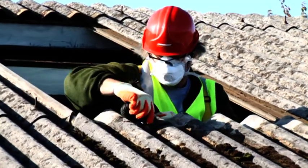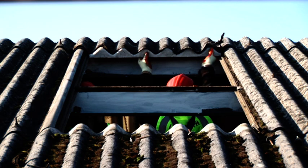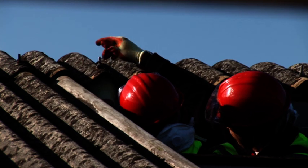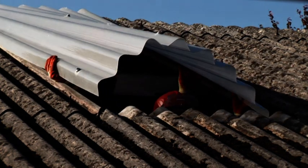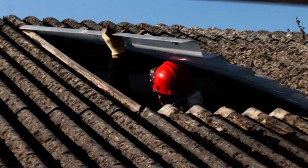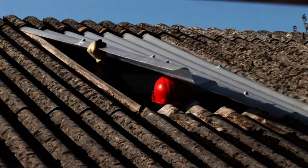Up at the roof, the old aperture is being prepared by cleaning away loose debris and fitting the upslope fixings through the upslope panel. An underlap fixing is placed over the hole above the underlap. The new sheet is then lifted up and through the aperture, taking care that there is not too much wind, and maneuvered into the underlap and slid up into a position where all the holes align automatically.